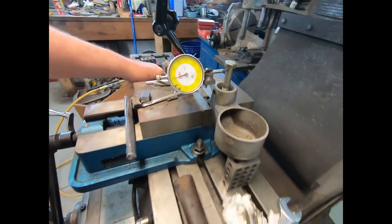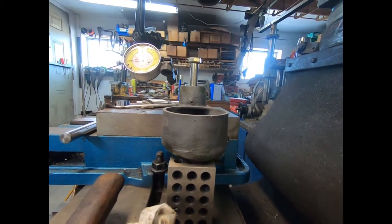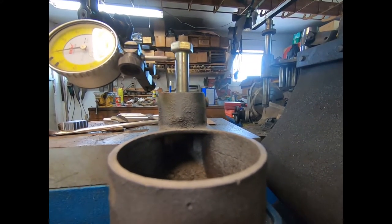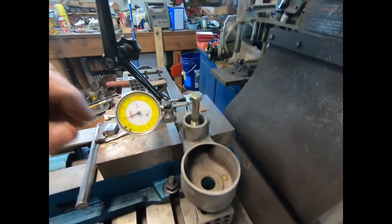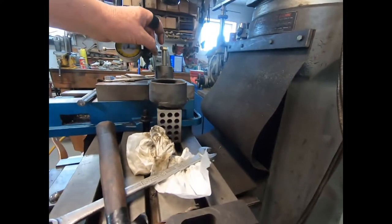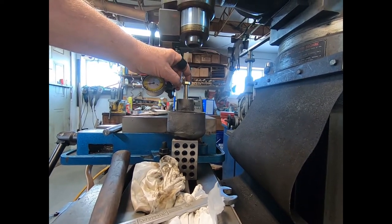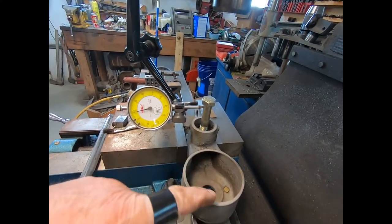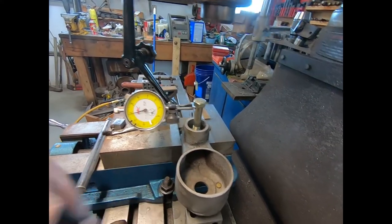And then when you look back at this, and you try to keep your vertical about you. Yeah, of course the camera keeps going off on me. I don't know if you can see that, but that bolt stands right off to the left, and I don't have the nut tight on it. Okay. Matter of fact, the indicator actually wants to hold it a little bit over to the right, but yeah, that dandy is off probably as much as 2 to 3 degrees from being flat to the top. So if you ever set up one of these and mill on your carburetor, just remember, this is different than this, and the seat is different to this. There's nothing on these that was good quality.